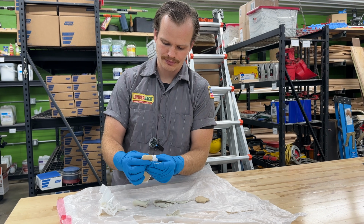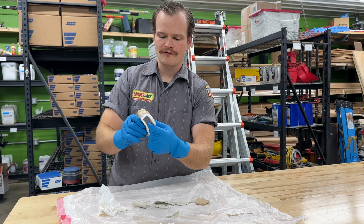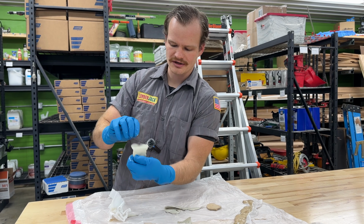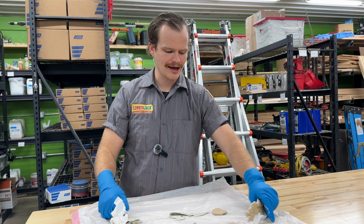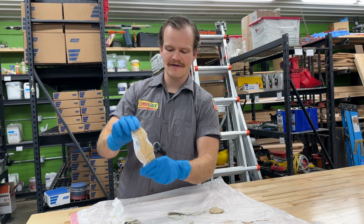This stuff is super springy. You can do a lot of repetitions cycling it back and forth before this stuff would break. You'd get a few with this, and mind you, it's still drying. This just has nowhere near the strength and elasticity, if that's a word, that the wood flooring adhesive has.